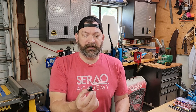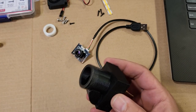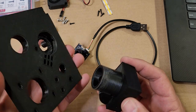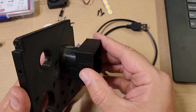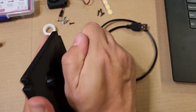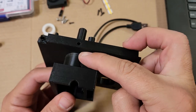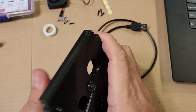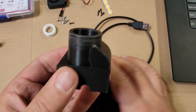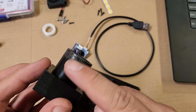It's slightly more available in other countries, so we're going to cover the construction of this because there's a different camera housing and light ring needed. The first thing we want to do is make sure our camera housing fits into the classifier base. We want a pretty snug fit — we have a set screw just in case it's a little loose — but I had a hard time getting this one in, so I had to sand it. I just sanded off the high points and scraped a little bit of the residual from the 3D printing.